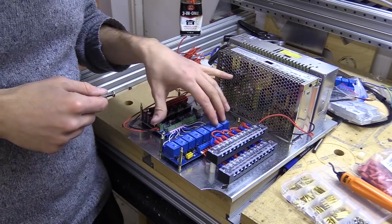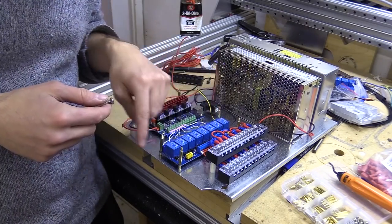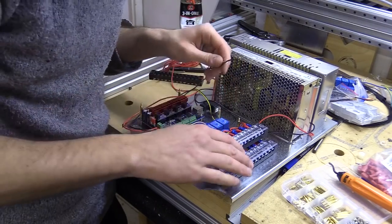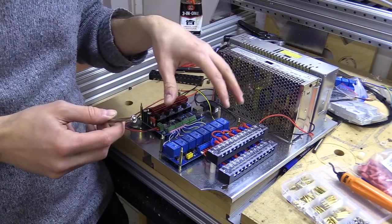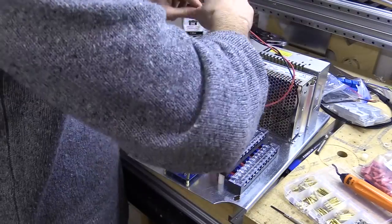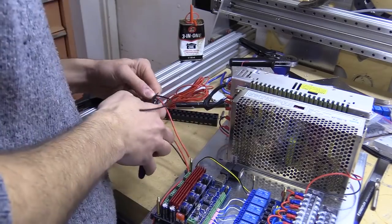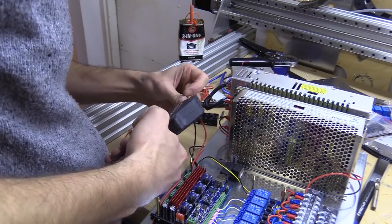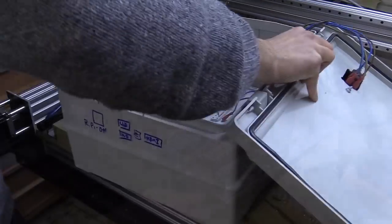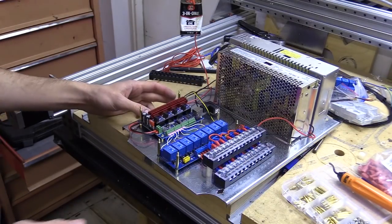So this is the Grbl M1 Pro, then I've got an 8-channel relay module board which has opto couplers or opto isolators, and I also have this set to active high at 24V. These are the barrier blocks which interface between the switches, limit switches, and the buttons. I've got 24V coming in being separated to where it's needed, and there's power that will come in from the control board going to the 36V DC. I've cable-tied that along the front to make it a little neater, so all the terminals are accessible and I can tighten them up if I need to.